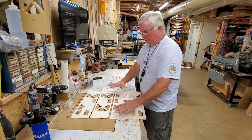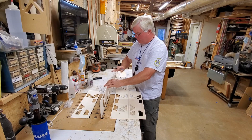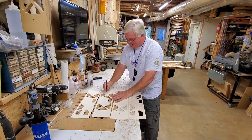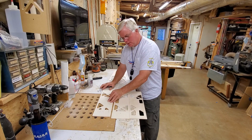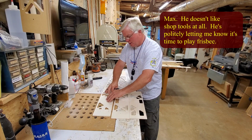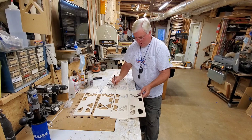Obviously we have two sides, and those sides are going to come up and face each other on the inside. This will be the right side, obviously, because this is down and up here. So I have found to keep these things straight, the best thing for me to do is to mark them. So I'm going to put an R right there, and this is the corresponding doubler for that side. And remember, it steps on the bottom here, so it will get glued on exactly like that. So I like to put an R right there. So when I glue these two together, I know that those R's have to match up. And of course, we're going to put an L here and make sure that that matches up exactly right.